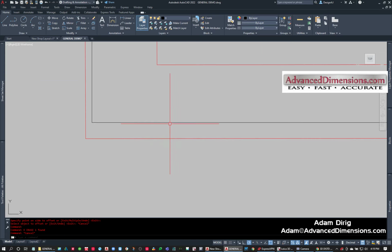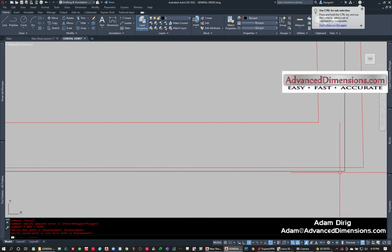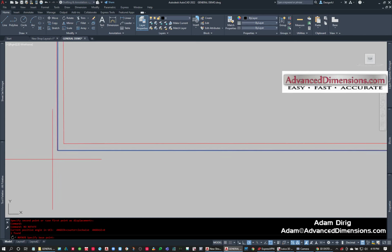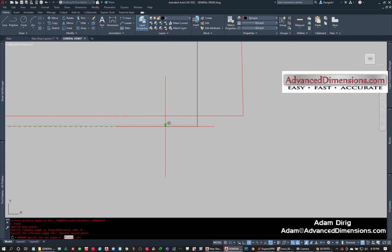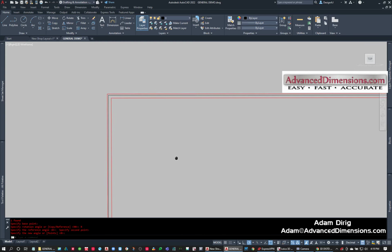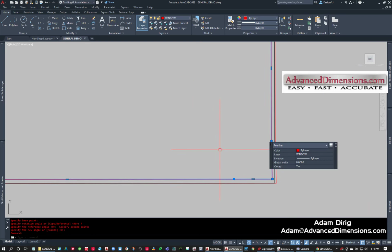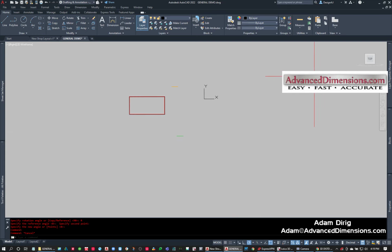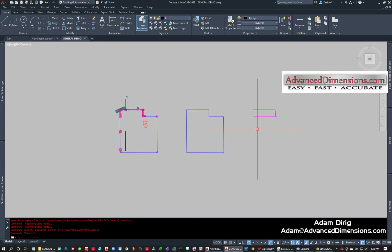And we could even go to the extreme of, okay, if this was actually touching that bottom, and look how off it is, it's going to rotate the glass, being a little bit particular on this glass, but I think this can help understand. So now my glass is sitting on the actual sill the way it's supposed to be, and I can look to see, okay, it looks like my glass is completely captured by this 3/4 of an inch stop, and everything looks good. So this is, like I said, a quick glimpse at what the 3D Disto can do, at the software, at how you would use this information.